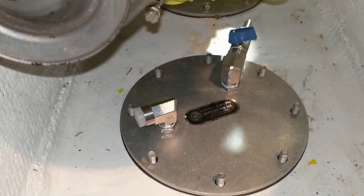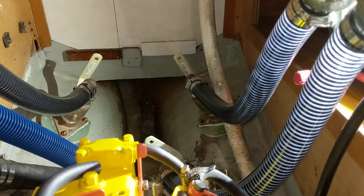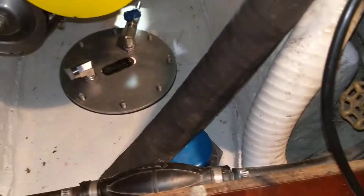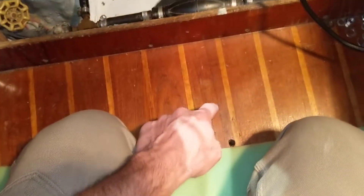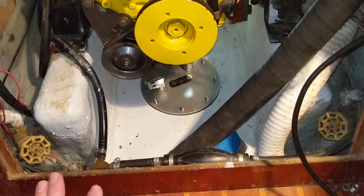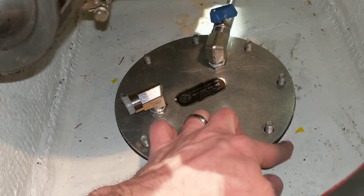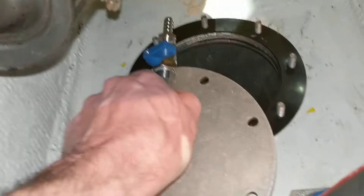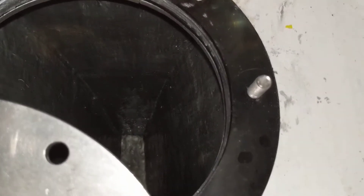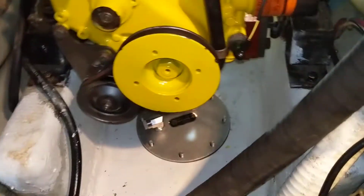At one point when I was putting in the through-hull Seacocks, I didn't have them sealed very well and only saw a little pool of water in the corner under the floor. I soaked that up and thought no problem. But the last time I visited the boat, about a month ago, I noticed water was seeping through the seal when I started to put the bolts back on. I lifted it up to look and there was a whole bunch of water in the tank — about half full — which I was not expecting.